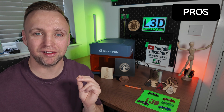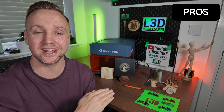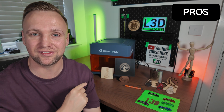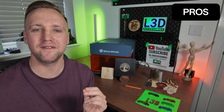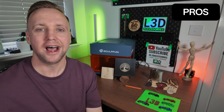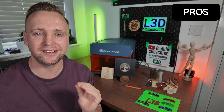Another thing I really love is the autofocus option. There's a button on the side of the unit — the laser comes down and prods the surface of the item you're engraving, then literally auto-aligns itself. That's something you don't get in a lot of budget entry-level lasers. The other thing to consider is exhaust fumes — when you engrave things you get smoke, soot, and fine particles. This machine has a filter built into it and also an exhaust that pulls it all out. That's a really great feature you don't see in many lower-level entry-level lasers, and it gives you peace of mind.